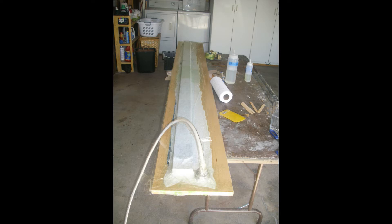To generate the vacuum I'm currently using a pump found on Amazon, normally used to evacuate air conditioning systems on automobiles. It is quite affordable at just over $50. I've tried several different sources for the vacuum bag tape. I find that generally you get what you pay for — if you buy the cheaper versions it will be harder to work with. The only significant way you can get good value on this material is to buy it in case lots. And by the way, if you work in a warm climate make sure your rolls of vacuum tape have release sheets between them. If you don't and it gets hot you'll end up with one massive blob of gooey butyl rubber. Don't ask me how I know this.